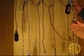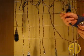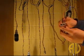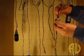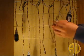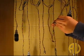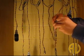A beep must be heard at power up. Next, we will use the green and yellow wires to identify the J1939 network. We insert the yellow wire in one cavity and then try the green wire in the remaining six cavities. Then we move the yellow wire to the next cavity and use the green wire to search the rest of the six cavities, repeating until we hear the beeps and see the J1939 LED light up.